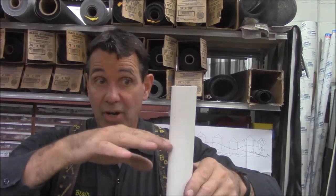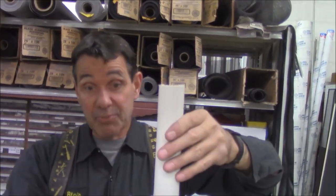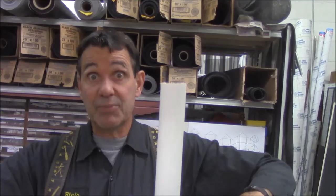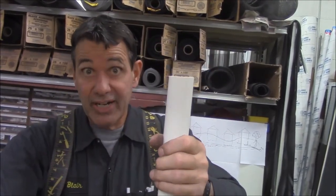You can look in the pipe and see the water level. If there's more pressure under your house than 18 inches and it comes up above this, the water has to be able to come out of this pipe and start flooding your basement. As bad as that is, it has to happen — because otherwise, if you cap or plug this drain, it can lift and break your floor.